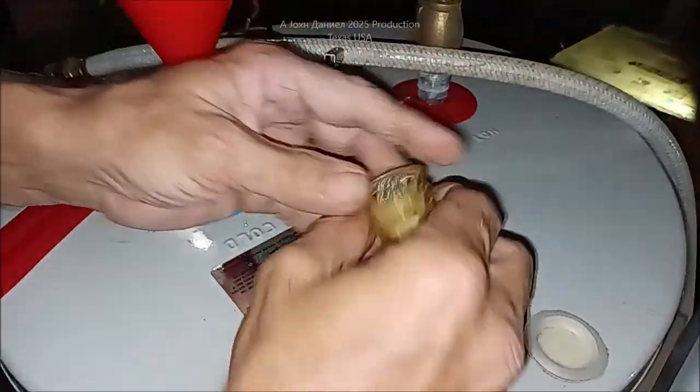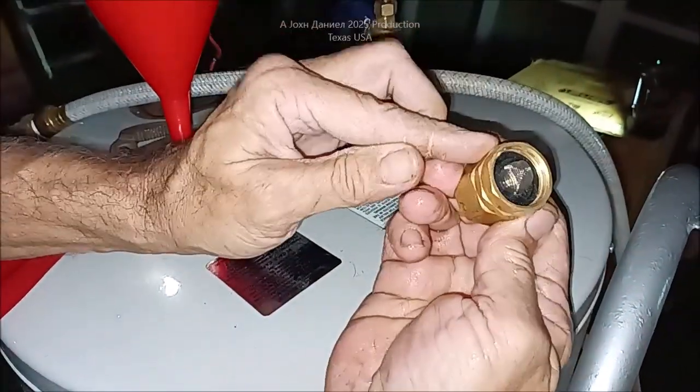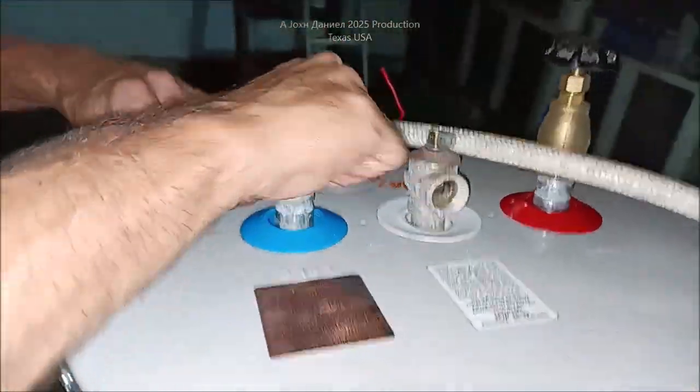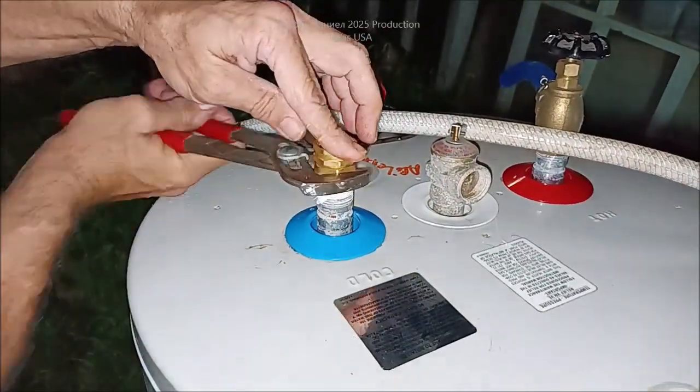What I've got is a swivel-style three-quarter IP — iron pipe size — with a hose fitting on it. You don't have to have the screen on there, so I'm going to take that out. I put a little Teflon around here so it doesn't leak, and I'm going to thread that on and just get it snug. You don't have to be macho — you're not walking away from it.